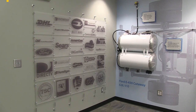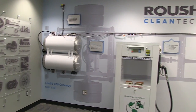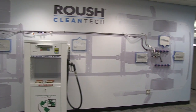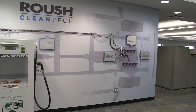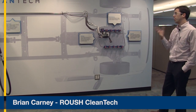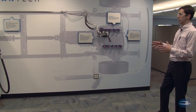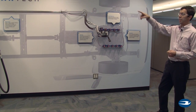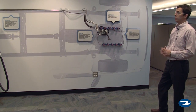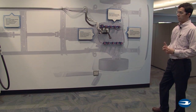What you're looking at here is a top-down bird's-eye view of a Ford E450. This is our fuel system as it would be integrated on that vehicle, and it's actually fairly simple. We've essentially removed the gasoline fuel system and replaced it with a propane fuel system. Starting with the fuel fill nozzle up at the top, which is in the same location as the gasoline or diesel fuel fill nozzle, we flow fuel into the fuel tanks, which sit in the same location as the gasoline tank.